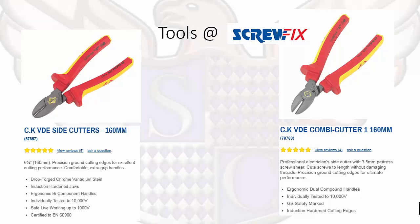The combi cutter is the same as our side cutters, apart from a difference: it also has a screw cutting device — the little hole on the combi cutter allows you to cut 3.5mm screws. So we have a multi-tool there. This is one of my favourites, the combi cutter, because if you're installing, for example fitting a 2-gang socket outlet and putting the front plate on, the screws might be a bit too big and you might need some adjustment — the combi cutter comes in very handy.